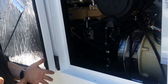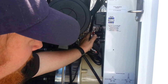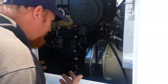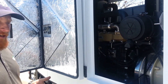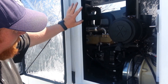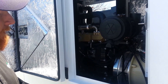Earlier I mentioned you have a charger and a block heater to help keep this engine ready to go — those connectors are right here. These little outlets tie into that one on the back panel. You've got a charger right here that helps keep your battery charged up and ready to go. On this side there's not a whole lot else to worry about. It's always a good idea before you go to run it to glance at the engine and make sure nothing's leaking, nothing's loose, nothing seems out of normal. You've got a whole bunch of different connections in here — coolant, fuel, engine oil — so just do a quick visual check and make sure nothing's leaking before you run it.